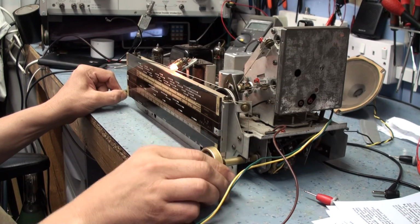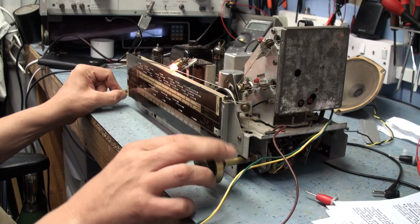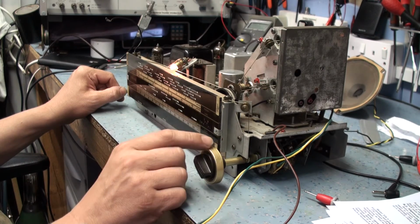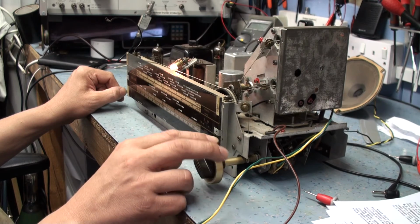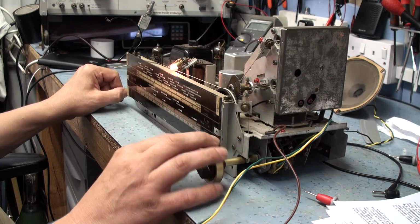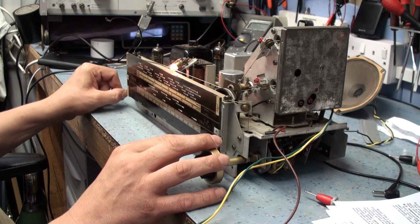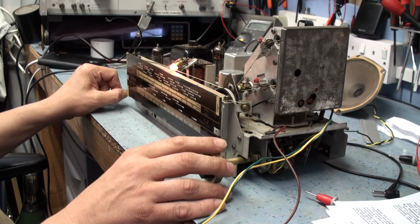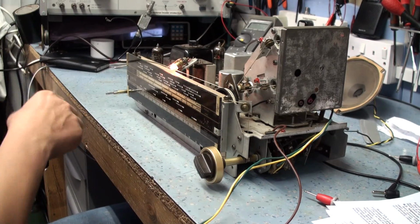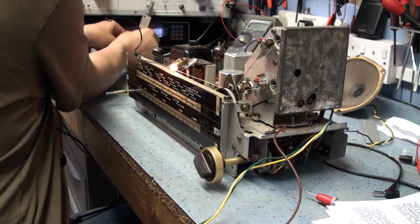I'll show you what. Pick up some stations. What happens is, if it tunes into a certain frequency, it locks the IF strip up. It almost stalls the IF or swamps the IF. And I think that's possibly a problem with the detector valve, which is an EABC80. You see, it works fine. And well, I think it's the IF blocking it out. If I give a load of IF signal through, put some IF through.